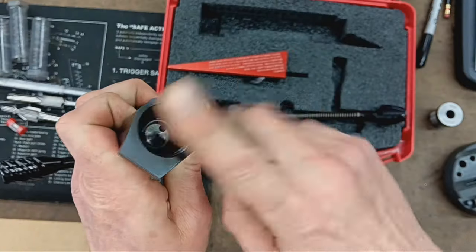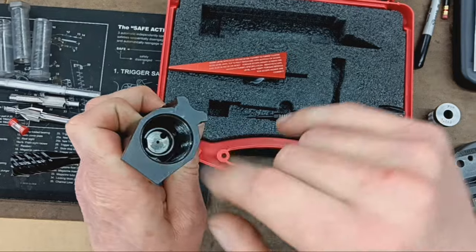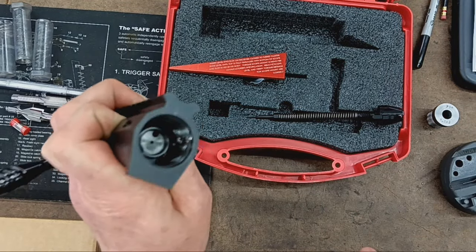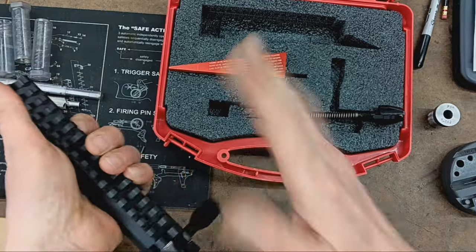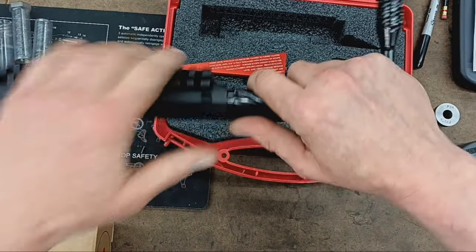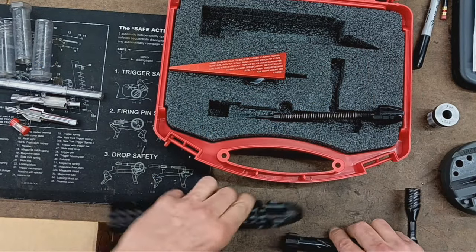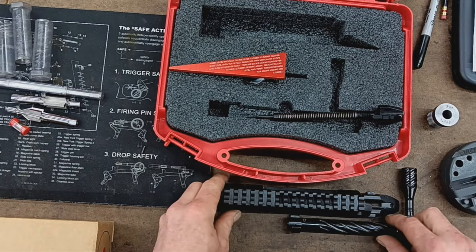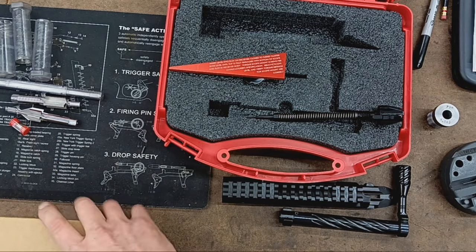So we basically just measure from here down to the bolt features, the nose, the face, and the lugs, on the back of the lugs. And then do a little bit of math to calculate our lengths, our depths, and our diameters. Right, so then the barrel.